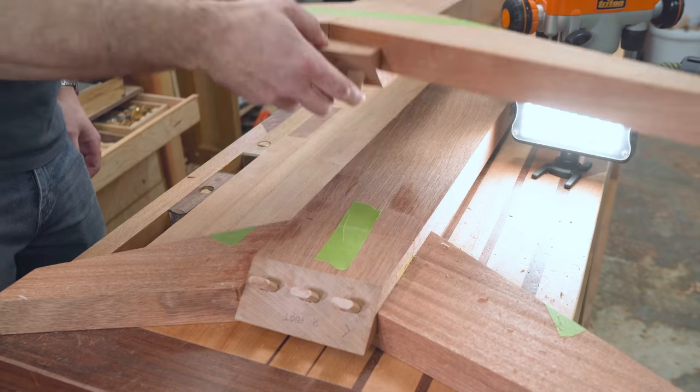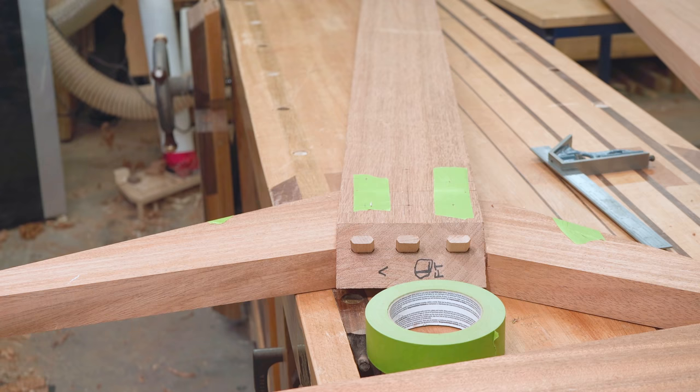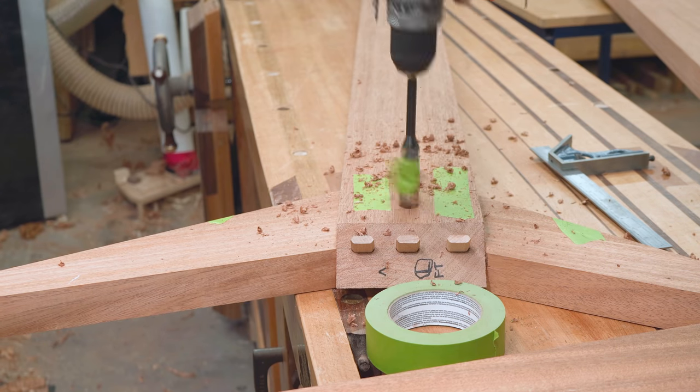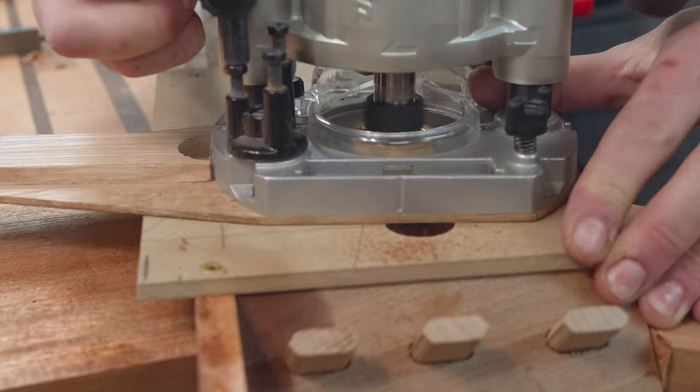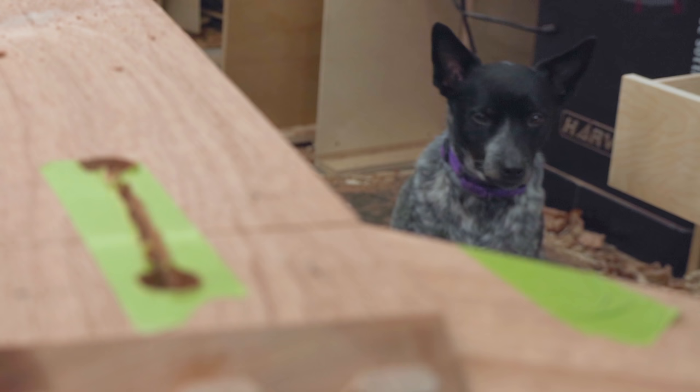Now with the headboard and footboard assemblies cross-lapped into the rails, we can get started on the breakdown joinery. We already indexed the joint with loose tenons, so zip bolts or countertop connectors are used to draw the joint together.